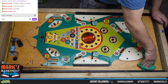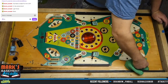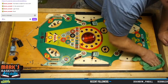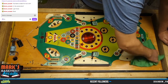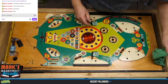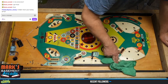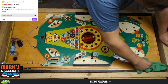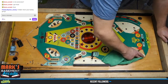So yeah, the power board has been upgraded at one time. However, I'm still going to pull it off and check all the solder joints and stuff. I can see there's new caps, there's a new voltage regulator on it, all that good stuff. But I still want to take it off, look at all the connectors and see if there's any cold solder joints and correct that. But yeah, that power supply has been upgraded and updated. So we are set on that.